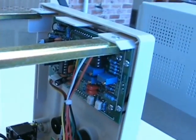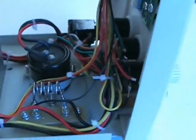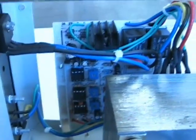Let's take a look inside. We have a front panel board which does the sampling and the display. I would also expect a current shunt — there's the output current shunt, pretty standard technology. And the main control board over here — an interesting aspect is that it uses sockets, which I'm quite surprised at. You don't see that too often these days.